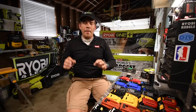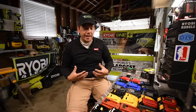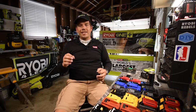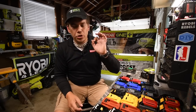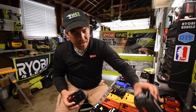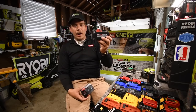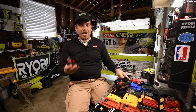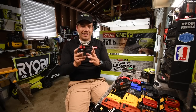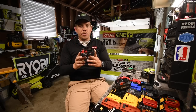So today I'm gonna answer a lot of comments that were completely negative towards me, with people just going crazy over a certain situation. I have a lot of comments saying that there is no difference besides duration between this and this. There are more cells in this battery than in this battery. Because this has fewer cells, it is not able to use the power that's already there, because it's straining the few cells that are in there to do the task.